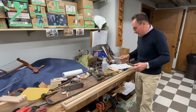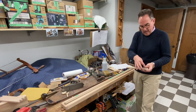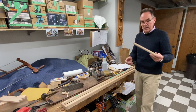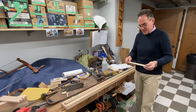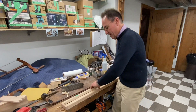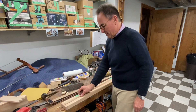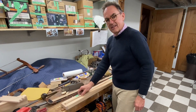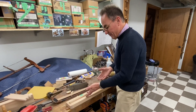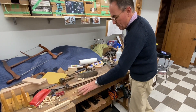For the angled section, Brad likes to make it four inches, so if you want to add two inches at the club you really need a six-inch piece of wood. He's interested in seeing how to attach the splice extension piece, because that's where there was a conundrum — you need a longer piece in order to actually clamp it and have leverage against the table to plane on.